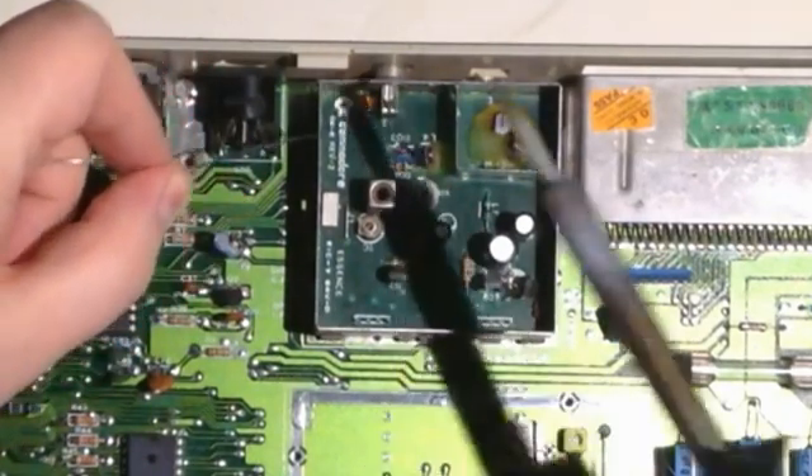Actually this part is very easy now. The trick here, if you're not used to soldering: you have to heat both the pin and the cable at the same time, and you have to keep it very still such that the tin will solidify and it won't move while it cools down, so it will create a good bond — or else you can get a cold joint. It's a composite signal anyway. It's difficult to do this under camera.